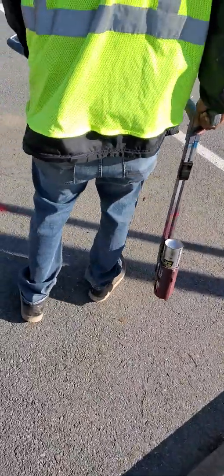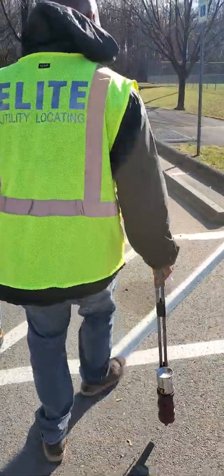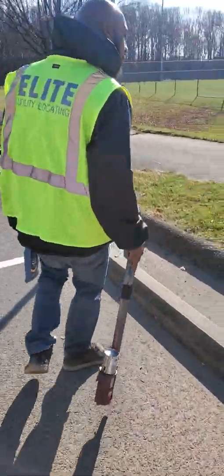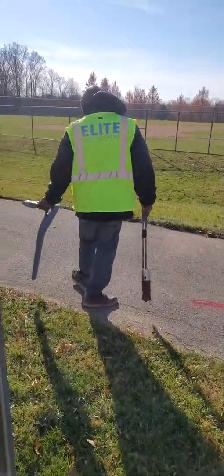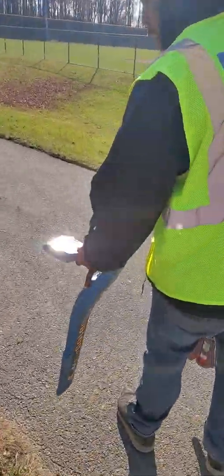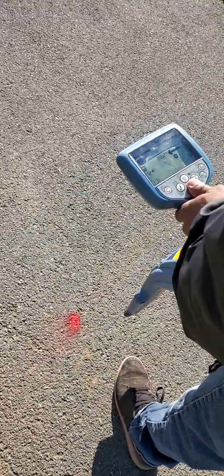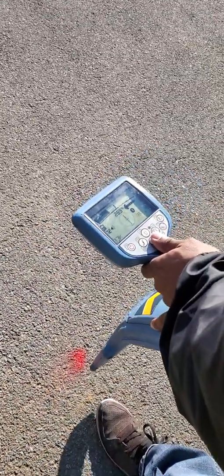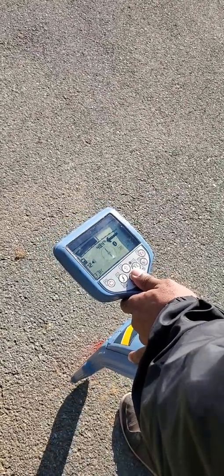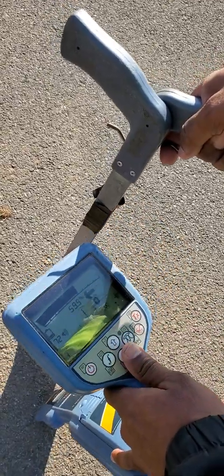Right here I'm getting good tone. I check my gain — I like this line. I put a dot and I can tell from my 360 sweep that I'm in the middle of the utility. We're going to find this line and mark it right here. This might be another electric line on the street light. I want to make sure I pinpoint exactly where the line is, so I take my time and get right on the dot, placing a mark right where I think the line is in the middle.